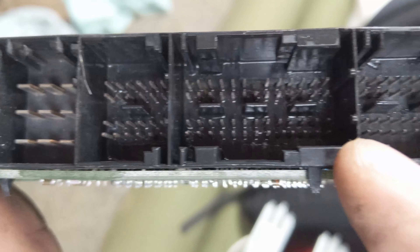I'm going to take a pair of needle nose pliers and pull that out of there, because I think that'll be the easiest way to do this. And I'm just going to try to re-solder a pin on there. I'm going to have to find a donor pin from another device, and then we'll see what we can do.